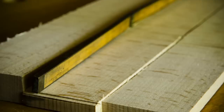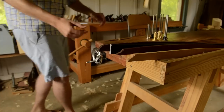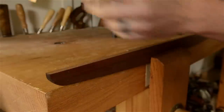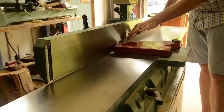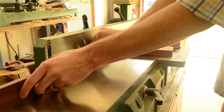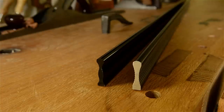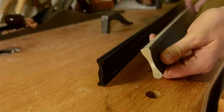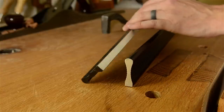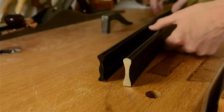Both styles have pros and cons. Wood straight edges are cheap to make, especially if you already have some stable quarter-sawn hardwood lumber. Quarter-sawn boards are characterized by vertical grain — it's just how you cut the wood. Wooden straight edges are also easy to repair if you drop them on the floor or if the wood moves over time — you just run a jointer plane over the edge, or run the straight edge across your power jointer. The downside is that the wood does move over time, and you need something to test its flatness on; the cast iron table of a table saw or power jointer are good surfaces. The pros of metal straight edges is that they don't have to be trued up and you can count on them to stay flat, because the good ones are precision ground to a tight tolerance — unless you drop them.